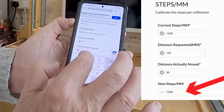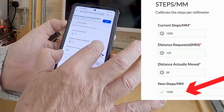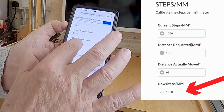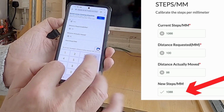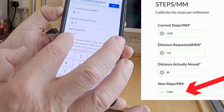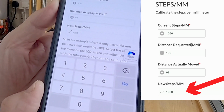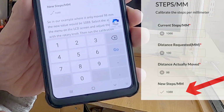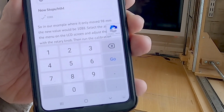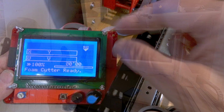So the current steps per millimetre is 1066, that's the default. And then if we moved 98, then you can see there, the new steps per millimetre should be 1088. So I hope you can see that okay. I'll put a better link up in the video as well. So what we do then,